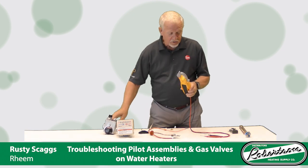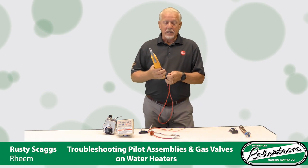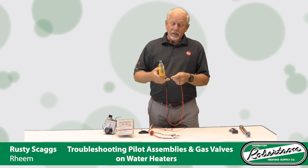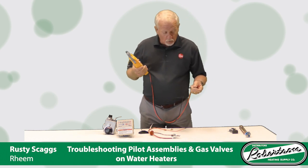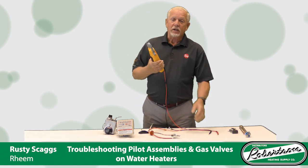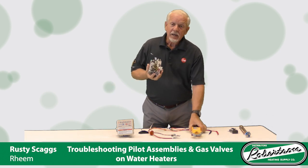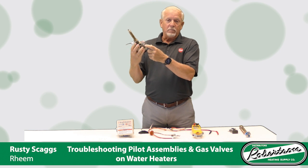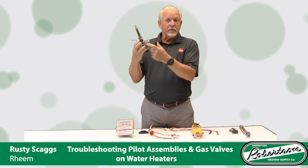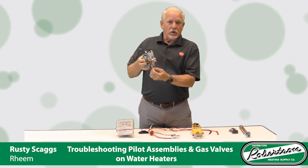This is the meter I'm using here. Any multimeter will work. I do recommend that you get a multimeter that has that beep or audible tone. A reason for that — a lot of times when you're testing this ECO in the gas valve, that valve's mounted in there and you need to test it where the thermocouple's screwed in. You can't see it, so you need to be able to tell if you're hitting where you need to.